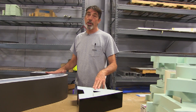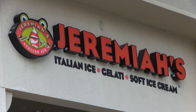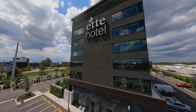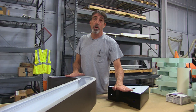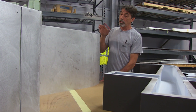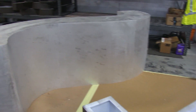A few of the different size channel letters that we build: this letter here is five inches, which is pretty standard on most shopping centers and storefronts. This letter for hotels is eight inches deep — standard for fifth, sixth, seventh floor, way up on the building, where you need to be able to see it from the ground. Then it gets a lot larger. The next size is what I'm building now — these are 20 inches deep. Some of the smaller case letters are 16 inches deep. I don't really have tools in the shop to build this; it's difficult with radius corners. Let me show you how I'm going to do this.